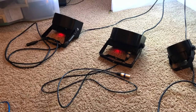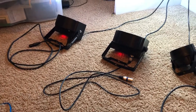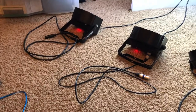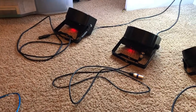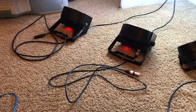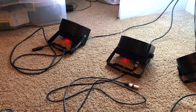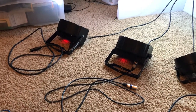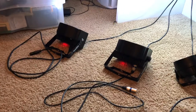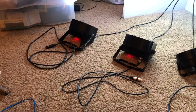Unfortunately, these YeeSight lights, even though they look great and work really well as lights, they introduce this terrible noise into my whole DMX line that makes them pretty much unusable to me. I can't use something that's going to throw off my sound. Unless there's a fix, I'm going to have to return them. And I don't know if that electrical interference could also be damaging some other equipment or my computer.